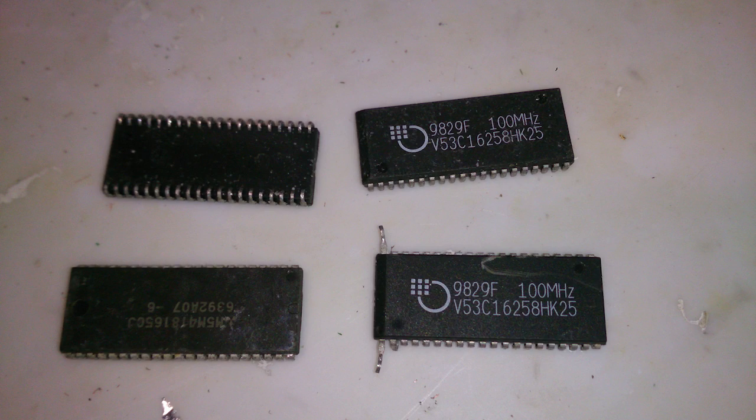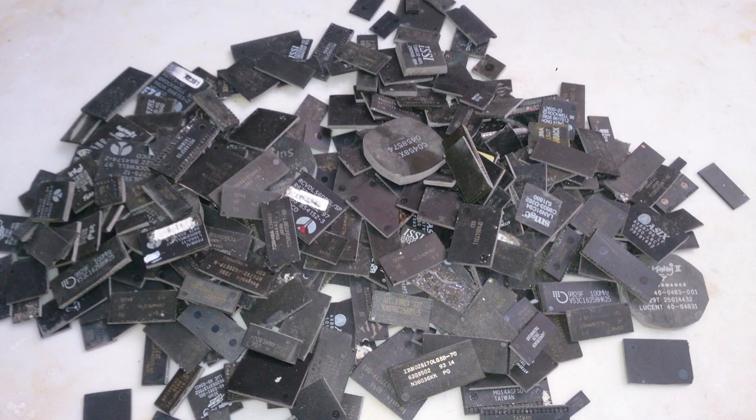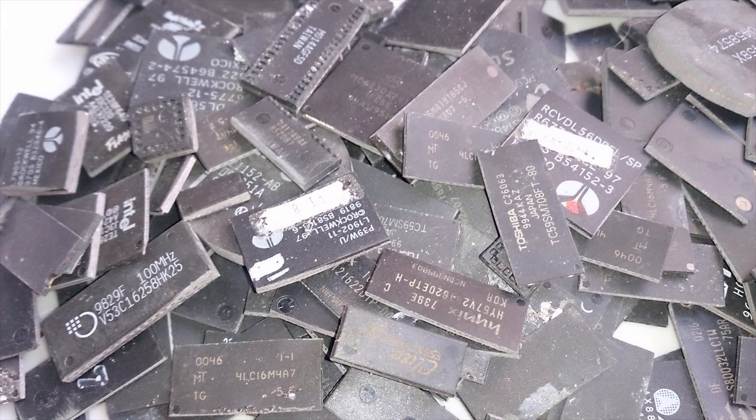As you can see, external contacts may be very long, and I recommend getting rid of them using simple mechanical or chemical means. You may leave your chips to the elements until the contacts simply corrode and come off themselves, or you can cut them off using scissors. Like myself, I used a bench grinder to remove them and it was really quick.